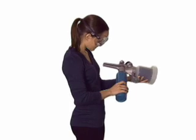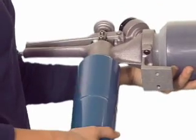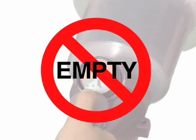Thread the fuel cylinder completely into the bottom opening of the ProSolve unit, allowing the top handle to rise freely. Briefly press the gauge activation button to determine the fuel content of the cylinder. If the gauge registers in the red area, the fuel cylinder should not be emptied with the ProSolve unit. Remove the cylinder and put it back into service.